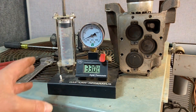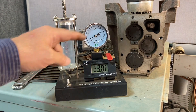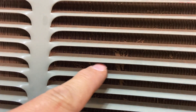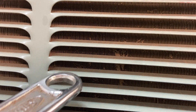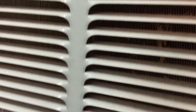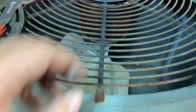This is the science behind it. That demonstration used air, but what we're actually going to use is a refrigerant. As we decrease the volume, we increase the pressure and the temperature even more, which allows for a better cooling effect. By increasing that pressure, when we get over to the condensing coil, the temperature of the coil will be higher than the temperature of the surrounding air. Air coming into the condensing coil will be cooler than the refrigerant, so the heat leaves the refrigerant and goes to the cooler air — that's how we're getting the heat out of the refrigerant. The fan on this side pulls air in, and on the top it moves that warm air out, so the fan is essential for this system to work.